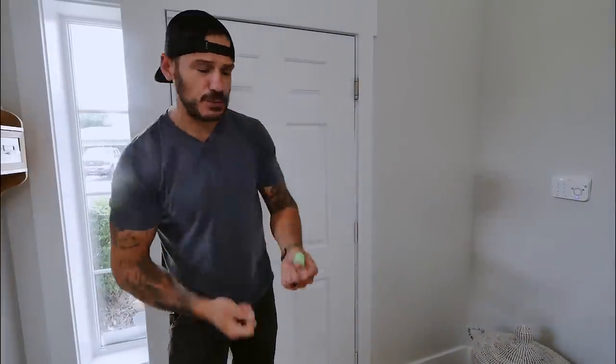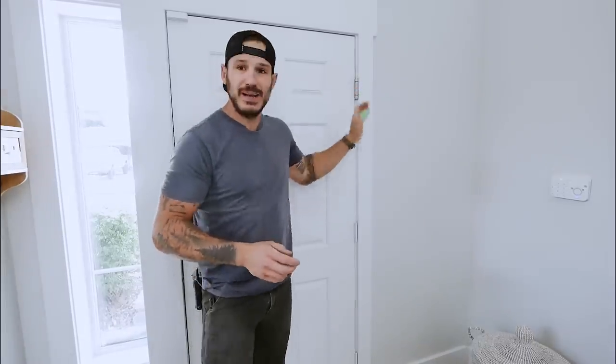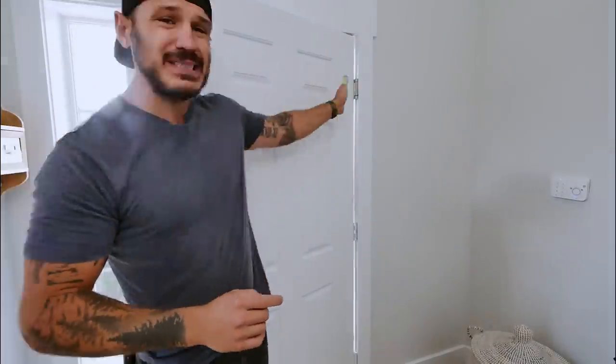Now, front doors usually have two ways of being attached. You have a classic hinge right here that you can use a Phillips screwdriver and knock it from the bottom up, prying it completely off. Or the second way is a self-closing, spring-loaded hinge, and that one you can't do that with. What you'd have to do is open the door, put something in the way to keep the flap from swinging open, and then unscrew the screws that are in place. So that being said, I'm gonna take this puppy off and bring it in the workshop, and we'll see what we got.